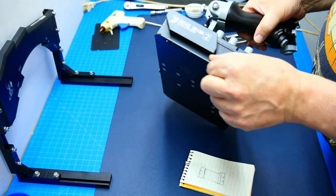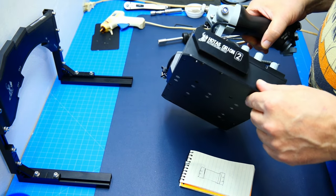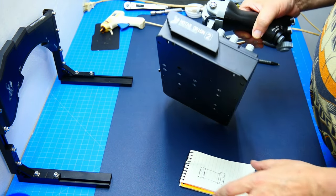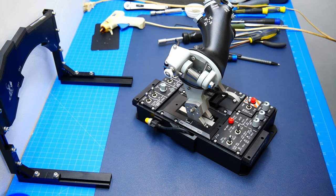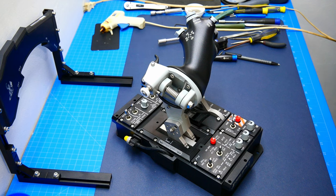Shouldn't be too complicated. I'm going to make this plate offset to the amount of the thickness of the case, this way it's all flat and when I tighten it down I don't break this edge off. Now I'm going to set you up on the vise first because we've got to cut a piece of aluminum and then do some milling.